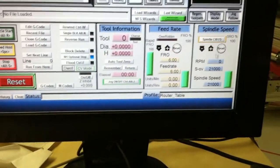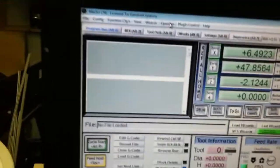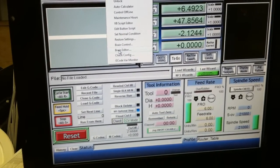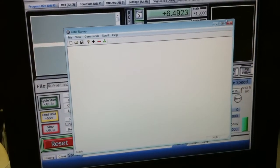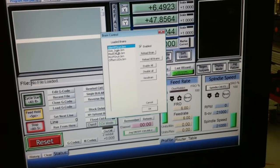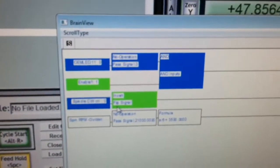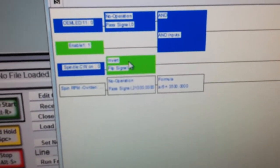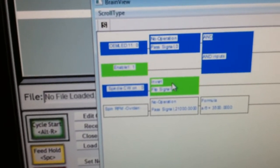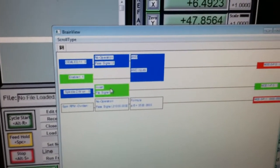In the brains for the spindle, to get it to work when you have it wired correctly clockwise, you have to go into the brain editor and invert the signal here from the spindle clockwise on — invert the signal because it's sending a 1 and you want it to send a 0 to the X200. That's the way you do it there.